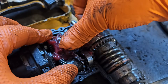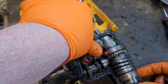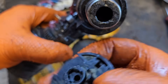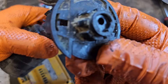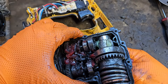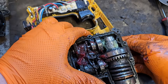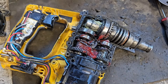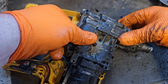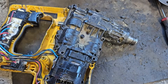It's important to make sure that the selector is in place at this point - to make sure your selector is alright. This pin has to go into a little hole there and your selector has to be sitting in the right spot. To do this, you have to do something a wee bit tricky. This is the switch from the side and you put it on. You see there's a shape. But don't turn the mechanism upside down - everything will fall out. You put that on there. Make sure everything is in place there. That helps you make sure that everything is moving. That's a pretty good tip to line everything up. So with everything lined up like that, you can just put the lid on again. And if you have lined it up properly, the seam should close over without any force - everything should just slot back into place like a jigsaw puzzle.